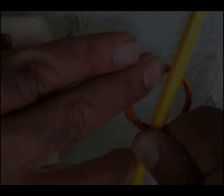It's important to make sure it's well balanced, because obviously this is a weak motor, and if it's too far out of balance, it's not going to work very well. One of the things you could do is put it next to a straight surface, make sure your wires are straight, and then look at it from this direction, make sure it's straight, and then try again. It might take a few tries to get it working really well, but I guarantee it ultimately works very well.